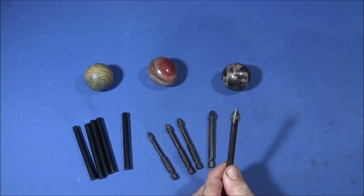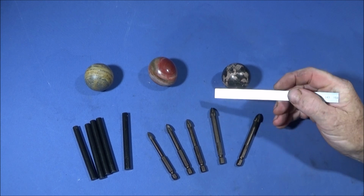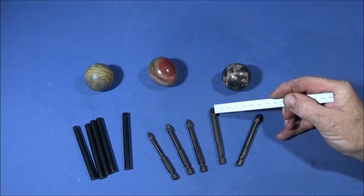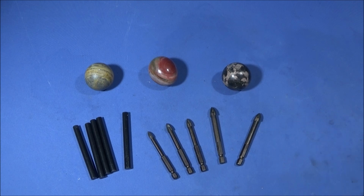And the different diameters have various different lengths. The 3mm one is 38mm, just say the 6mm, that's 41mm, the 10mm one is 55mm, and the 12mm is 68mm. And it gives all those details on that listing. So the various different lengths refers from the tip here to the actual hexagon part. Plus they also have a special coating on them to prevent rust.